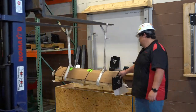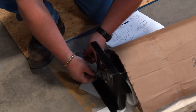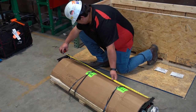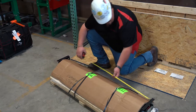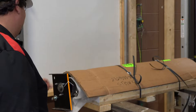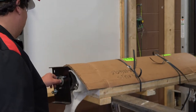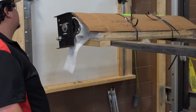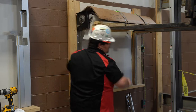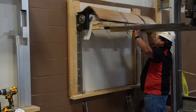This steel weave grille is being installed with a tube motor which comes installed in the shaft. At this time, you will loosely install the lower carriage bolts. Next, you will measure the distance between the brackets and compare that to your wall brackets. This is to ensure that the inside of the coil assembly bracket meets with the outside of the wall bracket. Prior to raising the coil assembly, be sure to position the brackets in the upright position with the mounting holes facing the wall. It may be difficult to rotate the bracket if you are too close to the wall. You will lift the coil assembly using the skid and center the coil assembly between the guides while leaving enough room that you will not hit anything with the coil assembly. Now you can slowly maneuver the coil assembly towards the guide and align the mounting holes of the brackets with those of the wall brackets.